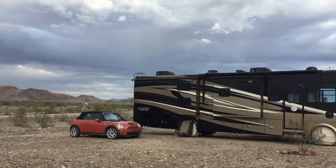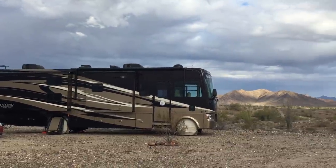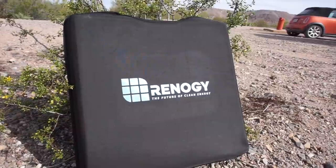We didn't have the goal of having this solar completely replace our generator. We just wanted to dramatically reduce the time we use it. When boondocking in Quartzite recently in cold weather, we needed to run our generator a lot to power up our batteries for the furnace and electronics — sometimes three, four, even five hours a day. It's a very fuel-thirsty generator and we spent about half a tank, around 35–40 gallons of fuel, in two weeks just charging batteries. With a solar setup we would have dramatically reduced that, which helps pay for the cost of the solar really quickly. Now that we're doing more boondocking it made sense to get some solar to meet our basic needs of keeping our batteries, lights, and electronics charged.